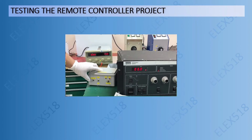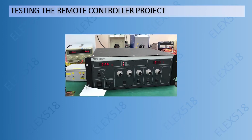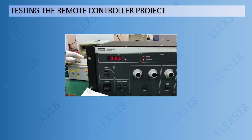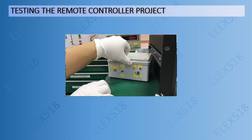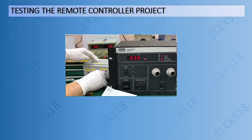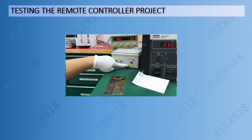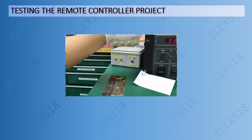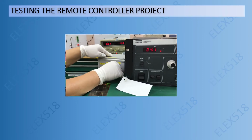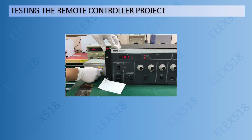Okay, I turn on now. Okay, all activated. The solenoid, source, and interlock. Okay, now at arc mode, so I need to increase the arc voltage. It should also increase the voltage here. By the way, this arc is controlled by 0 to 5 volts. So 5 volts is the maximum voltage that will display here and equivalent to 3 volts. So let's adjust now the voltage from 0 to 5. You can see the voltage here also is increasing.